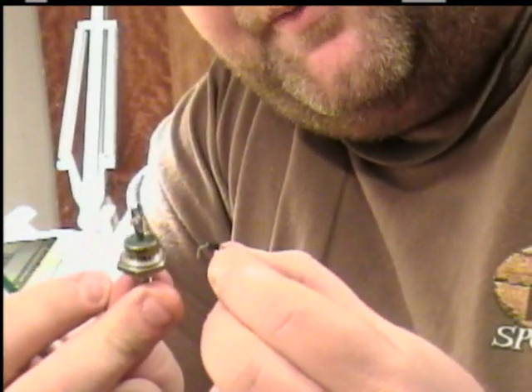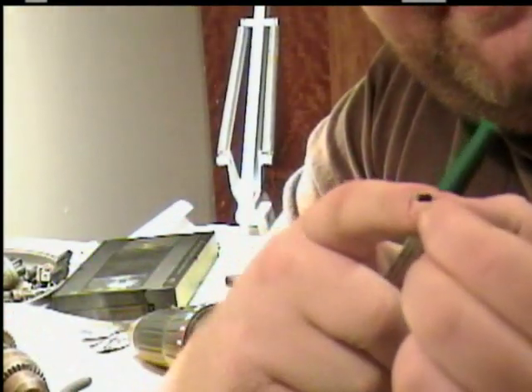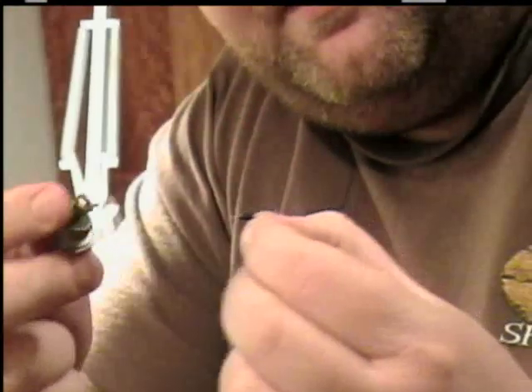As you can see, there's a big difference between the two. This one here is probably about a 50 amp diode, and this one here is about a 1 amp diode. The peak inverse is the most important part — it's the check valve feature. Let's say that this diode is a 50 volt peak inverse.